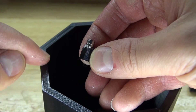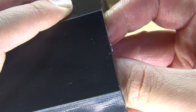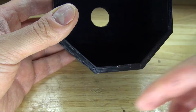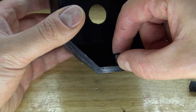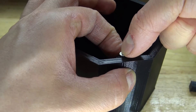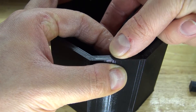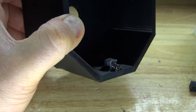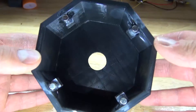The reason the magnets are positioned like that is so they can be flush with the side of the housing. Make sure the magnet on top is aligned with the rim of the housing. Take some superglue, put some on the side, glue the magnet in place, and push it down to make sure the top magnet is flush with the rim. Spray some activator — perfect. Add more superglue to make it extra strong, spray more activator, and it should look just like this. Now repeat the same process three more times.